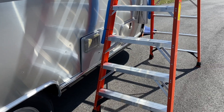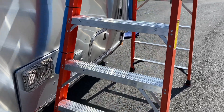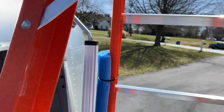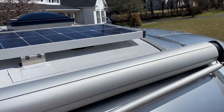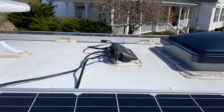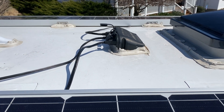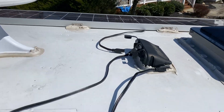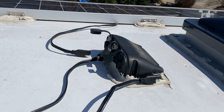What I've determined is the only way — because there's no shutoff on the solar panels — the only way to disconnect that is to go up on the roof. The only solution is to reach in there and unplug those connectors. And there you go — all three are unplugged, so there should be no voltage coming down into the charge controller.